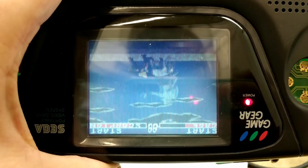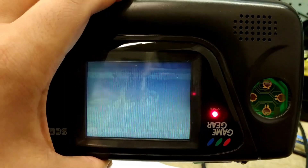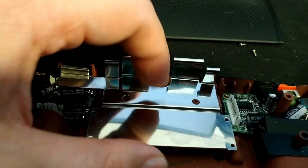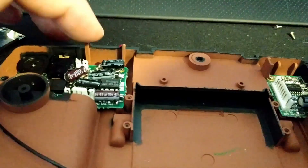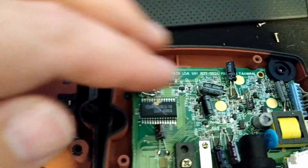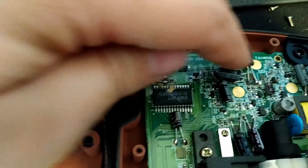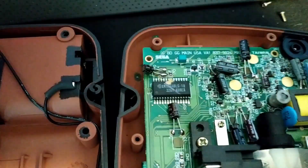After all the capacitors were changed, the first full test — it works flawlessly. The buttons and back half aren't installed yet, this is just testing. I was fairly conscious of capacitor height and keeping things flat. The audio board looked like a tight fit but it just squeezed under the metal shield, which I put back in. There are also posts on the case — not screw posts, just supports for the back of the motherboard where the buttons are, to keep them from flexing. Some capacitors were in the way of those posts so I had to bend them aside.